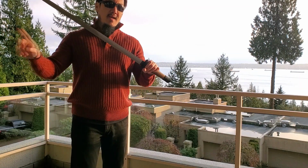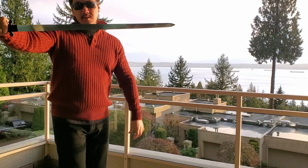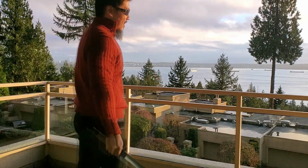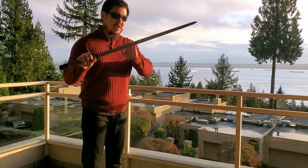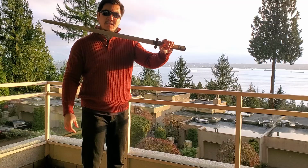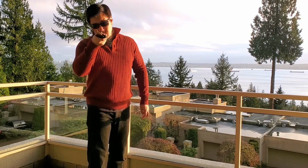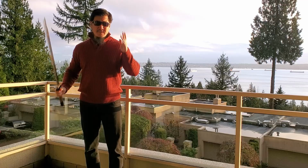This blade is mono-tempered and hardened with a spring temper, as I discussed earlier. However, on the blade, there is some differentiation of coloring between the spine and the edge. This is most curious, as this distinction usually appears on differentially hardened steel. So I'm not sure whether this is caused by different polishing or there's some differential hardening process to it, but it looked quite unique. The blade is perfectly straight, both the spine and the edge. And there's minimal rippling on both surfaces. So indeed, a very well done blade.